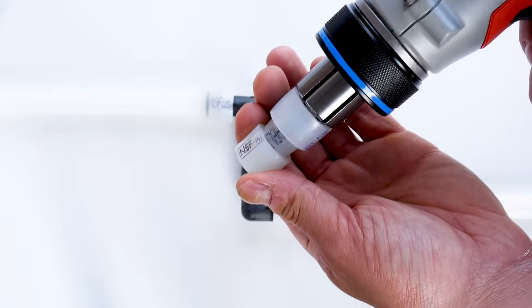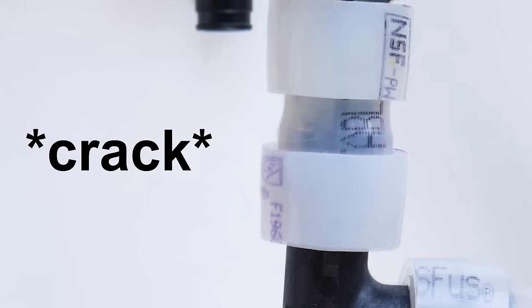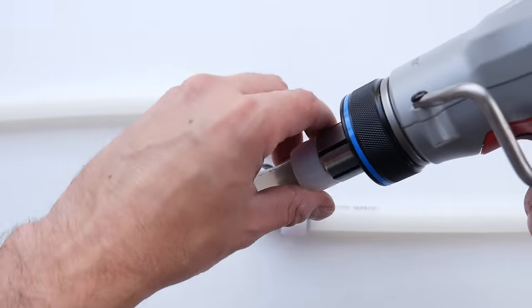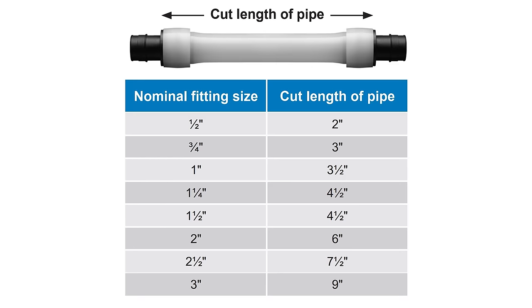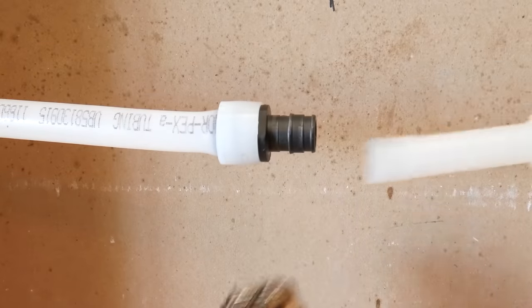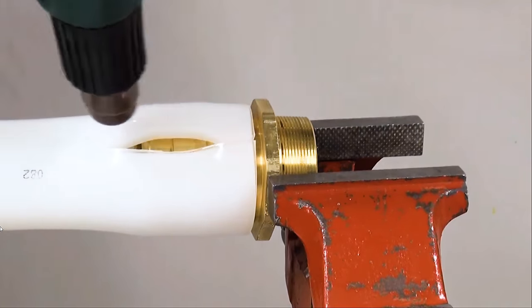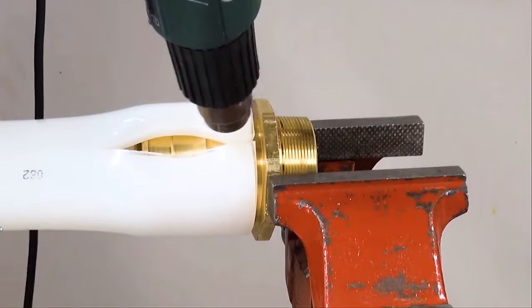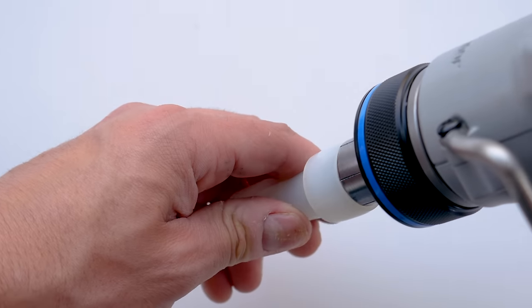If you were to expand one side, insert the fitting, and then expand the other, the tool's head would go into the other fitting and crack it open. So you'd basically fully expand one side, then the other, and alternate on both sides a couple of times before installing. Here's a chart that gives you the minimum length for each pipe size. As for disassembly, just heat the joint with a heat gun, cut the ring, and pull the pipe out. Make sure that when doing this you don't nick the fitting, as if you do it'll leak. On smaller fittings it might be worth just replacing it, but on larger diameter joints it could really be worth the time as the fittings get really expensive. And if you expanded a pipe and got distracted for whatever reason, you could expand it as many times as you want — so it's very forgiving.